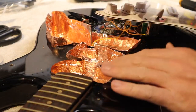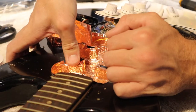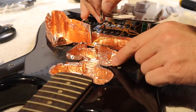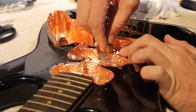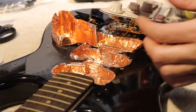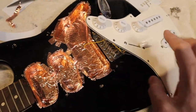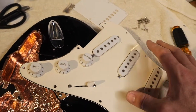Now with all our pockets lined, we have foil lipping up over the top. We're going to go around with a razor and fold the foil up over the edge so that when you put the pick guard back on — which will also have foil on it — it makes contact and creates a nice seal all the way around. When you're done, none of this is going to be seen; it'll all be enclosed underneath the pick guard. Make sure excess foil isn't poking out past the screw holes, and just trim it back with a razor blade or scissors.